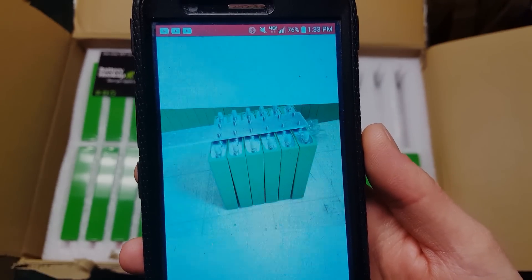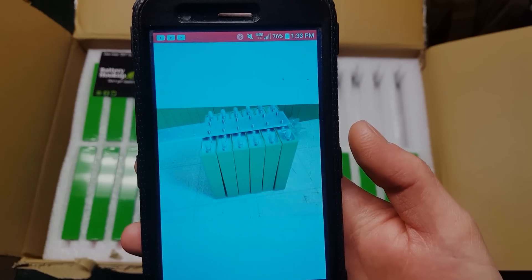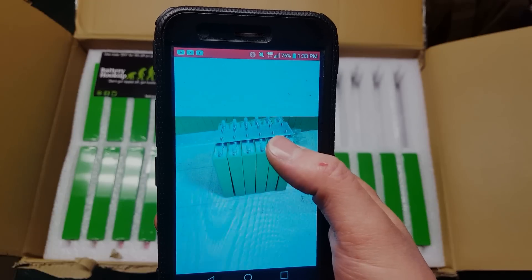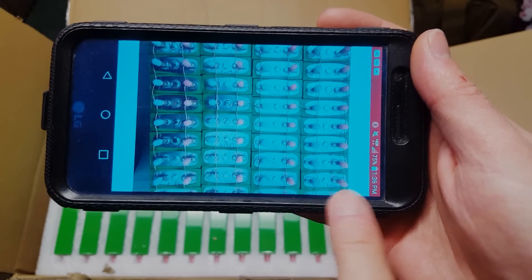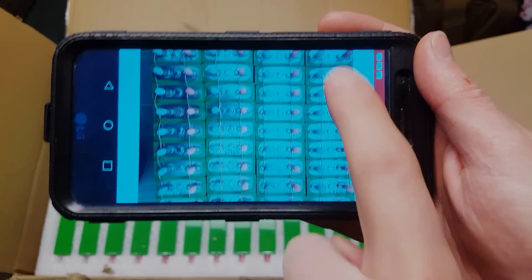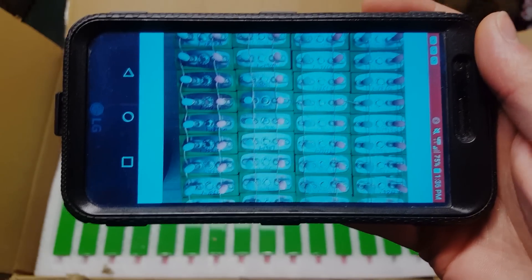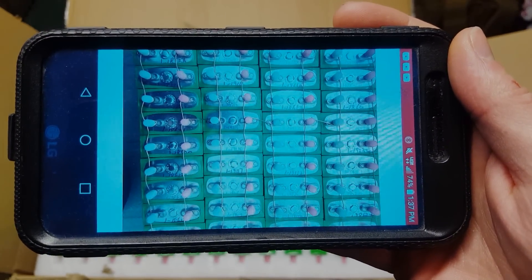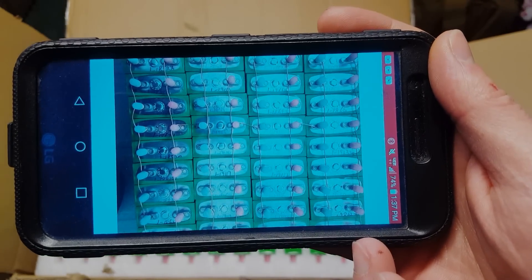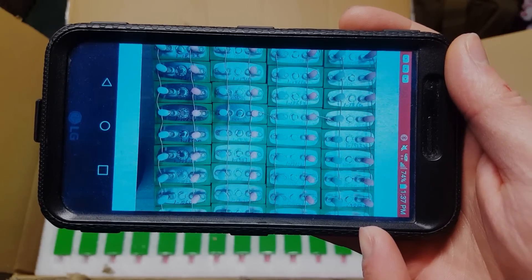I can't wait to show everyone how these things fit together perfectly. You can see at the top here how tight these cells are together, and then the bottom still has a bit of a gap. We're going to strap these together to make sure they don't want to swell or move at all, and to take the stress off of the terminals. You may have noticed on his setup right now — because he's going through and top balancing all of his cells — he has some bare copper wire on here. Basically what he did was made four rows for a 12 volt battery, tied all of these cells in parallel across each row, with series connections between rows. He put a few connections along here just to spread the current out. Right now he's going through trying to top balance these — you should always top balance cells before you put them in service, and you should never rely on a BMS to do the balancing for you. You should always take the time and do a thorough top balance. These cells should be able to go into service after this top balance, and I don't think he'll have to touch this for years and years. It's going to be a really solid setup.